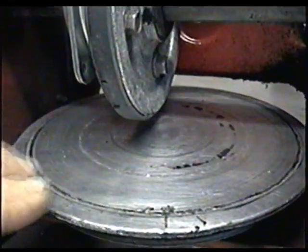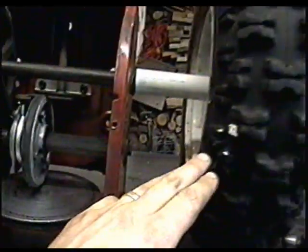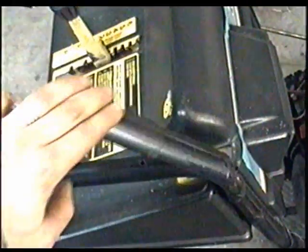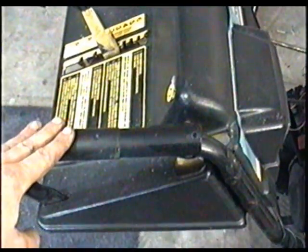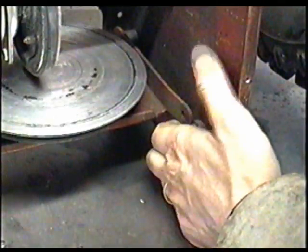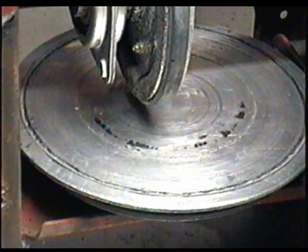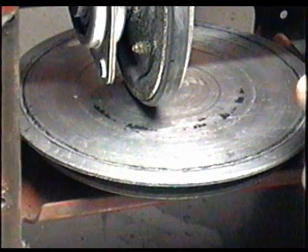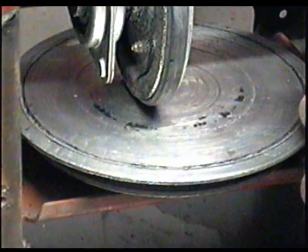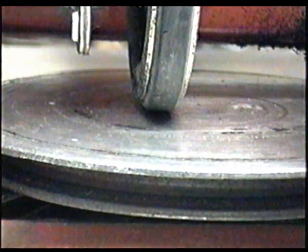Here's a closer view of these two parts. As you can see, there's no contact between the wheel and the disc, so the wheels are not going to turn. But when you push down the drive lever on your snowblower and hold it down, that lifts the friction wheel — your cable is connected over here — and the friction wheel touches the friction disc. When you let go, it goes back down. You need good contact so they don't slip.